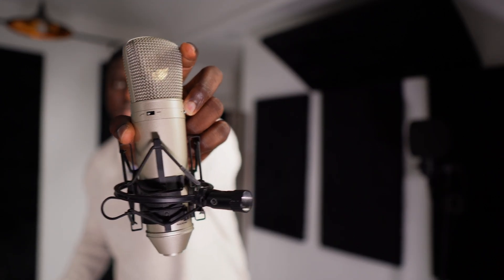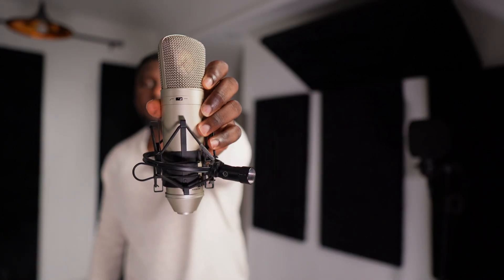We also have a high pass filter here. What this does is tell the mic how sensitive it should be in terms of frequency pickup. Different mics may have different high-pass ranges — some at 100 Hz, some at 150 Hz, some at 80 Hz. If you engage the high pass where it looks like there's a cut on the mic, it means the mic won't pick up enough bass or low-end information.